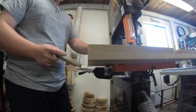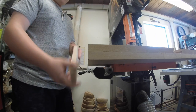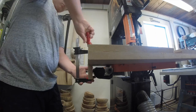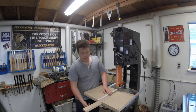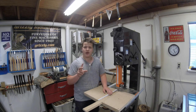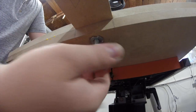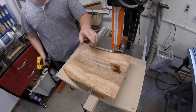I have the slide positioned on the bandsaw table so that the center of that sliding track is in line with the blade. I'm going to go ahead and glue down a stop so I can never push it past that point. The very last thing I did was drill a 3/8 inch hole on the underside, put a T-nut there, as well as a knob that I made using a 5/16 inch bolt with a little piece of wood glued into the top to make a little star knob. That allows me to adjust and lock it in place so it won't move around.